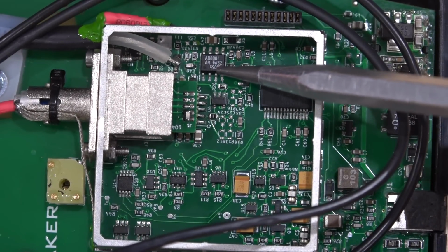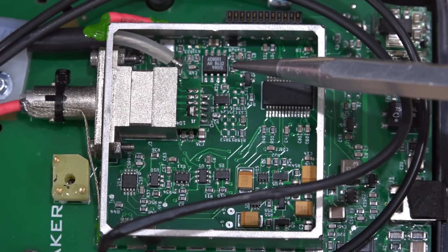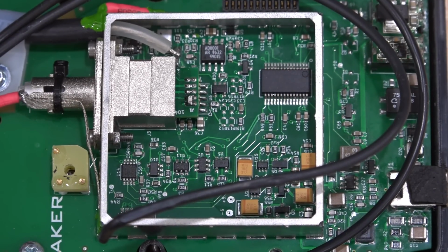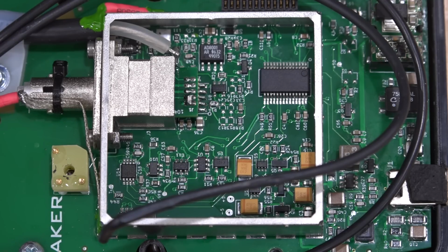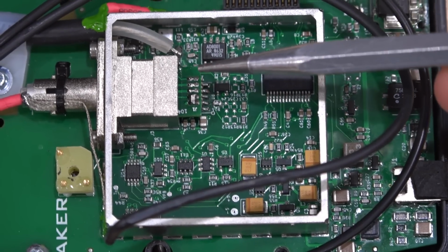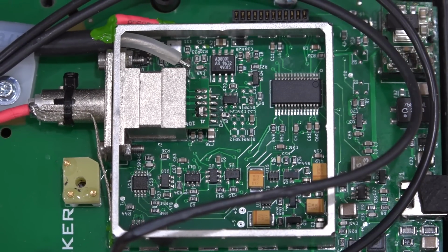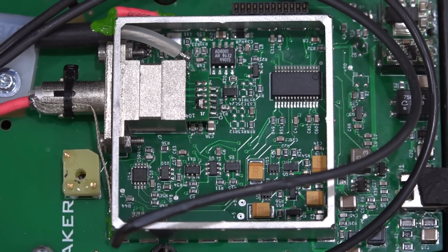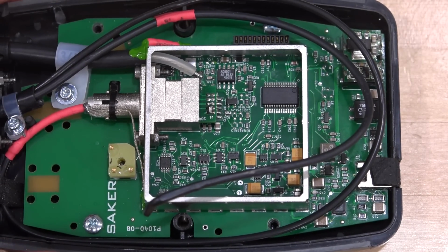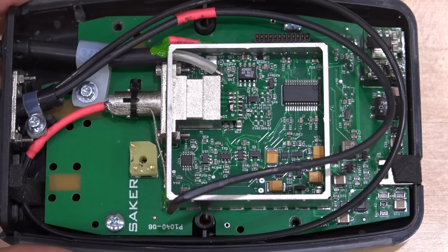And this is an Analog Devices AD8001, which is a line driver. It's actually a current mode feedback amplifier, which is nice because it can interface with the photodetector reasonably easily. And then from there, you will have a lot of current driving capability to drive this coax into 50 ohm. Now this part is rated at 5 megahertz for 65 dBc of THD, which is pretty good, and that means that it's going to maintain the linearity.